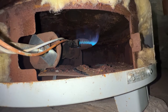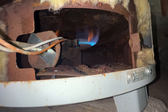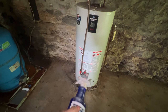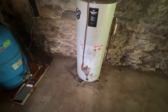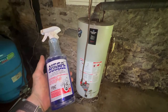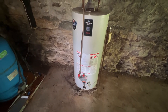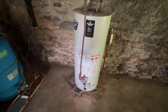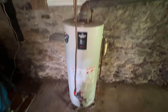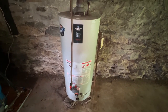Now let this heat up. Make sure we get hot water and make sure it shuts off when it should. I also used some of this to check all the joints here, especially the ones that I redid, just to make sure that there are no gas leaks. I'm not sponsored by these guys, but it's a good product, makes bubbles pretty well, and it's easier than having to mix up soap and water and dab that on. So I just did a little bit of that and everything looks good. Okay, so it shuts off as it should. I think we should be good to go.